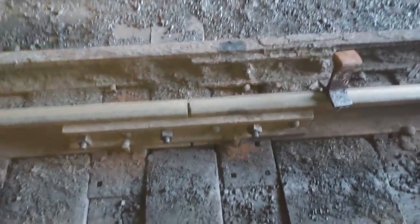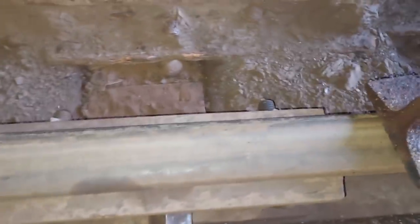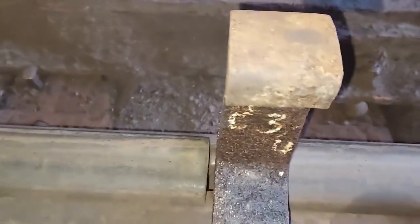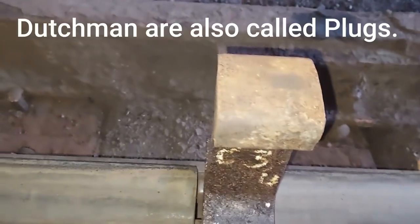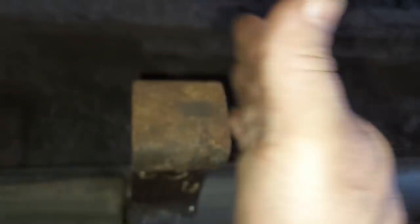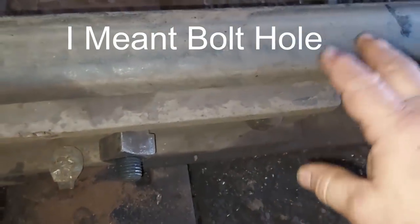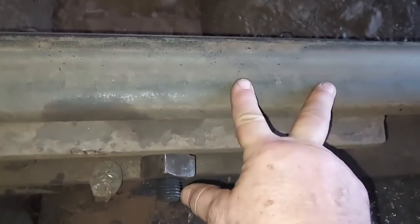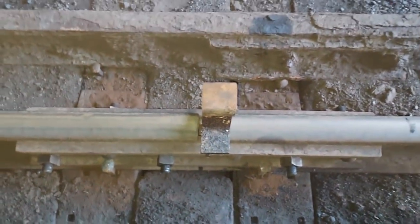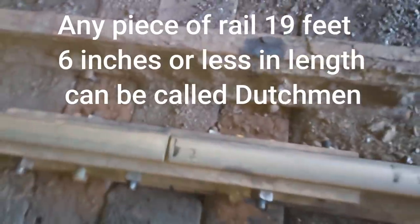Since I can't use the fire snake, what we did was take the joint apart and put a little dutchman in there — it's called a dutchman. I've got a bunch of these in all different sizes, from small on up; I even have one about five inches long. This made a quick fix. Because the bolt was actually outside the joint bar, in order to make it fit we drilled two holes, so we ended up with two bolts on one side and three bolts on the other. Then we ran trains the rest of the day on a 10-mile-an-hour slow order through here — it's a great short-term fix.